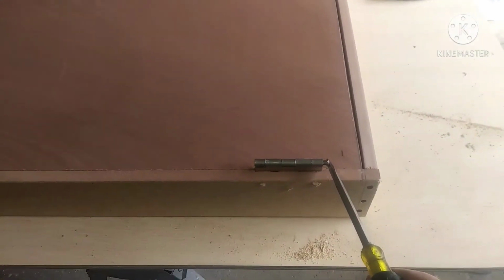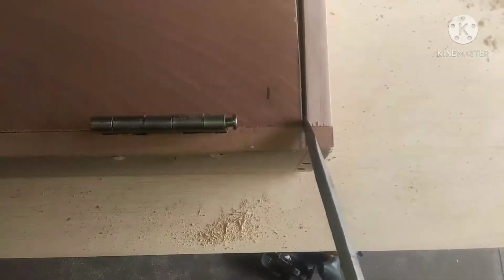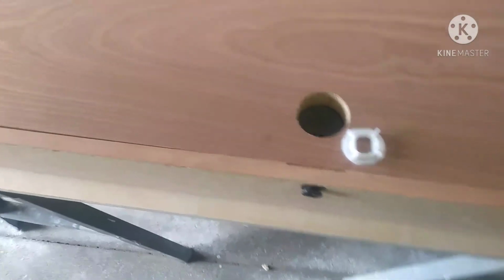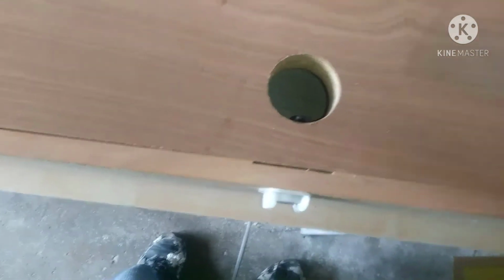So you can see that top hinge is kind of high, but either way, if you cut it from the bottom or the top, the hinge is going to be weird. I guess you could move it. And then you've got your nice little reveal gap there for when you put it back in. So yeah, if you have to do a project like this, my recommendation is to cut it off of the top for sure.